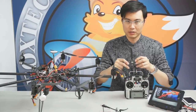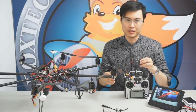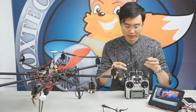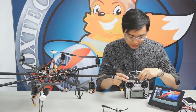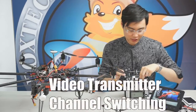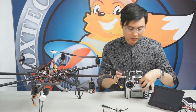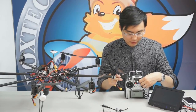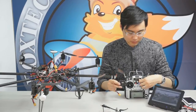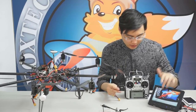The other switch is to switch the 8 channels on the DJI 5.8G transmitter. It has 8 channels but there's no physical switch on the transmitter itself, so you have to use the switch function on the IOSD Mark II to change the channel. Here you can see channel 1 or channel 2 — and now it's back to channel 1. You can see the channel icon displayed on screen.